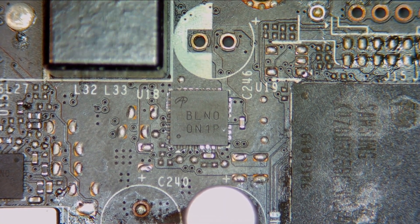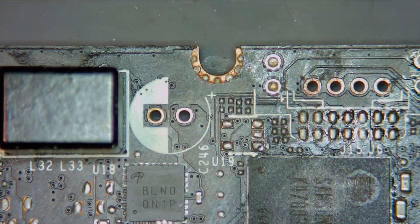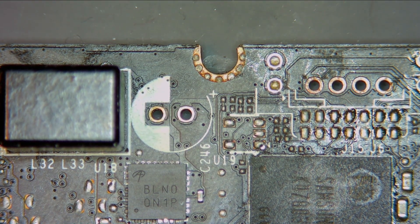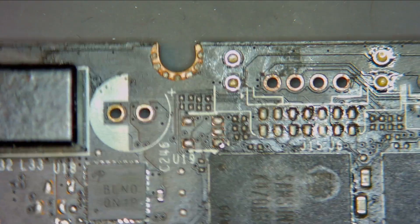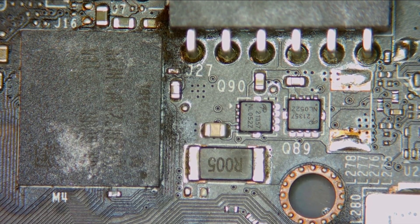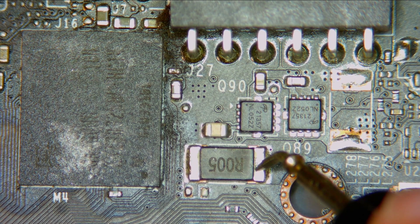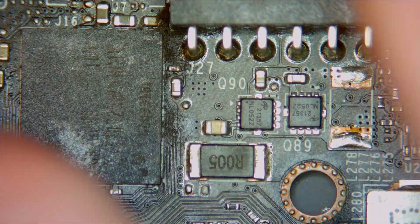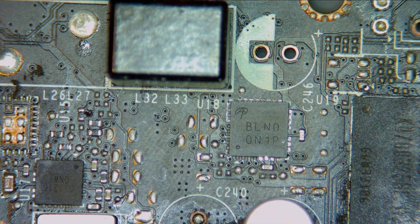Here's the look of our replaced component — everything looking amazing. We're going to replace this capacitor here right now and then that should be good. While we're at it, let's check for the short circuit. On ground, multimeter on ground, checking 12 volt — and our short is gone. We actually had that correct the first time. Great news — this card is now ready to be tested.